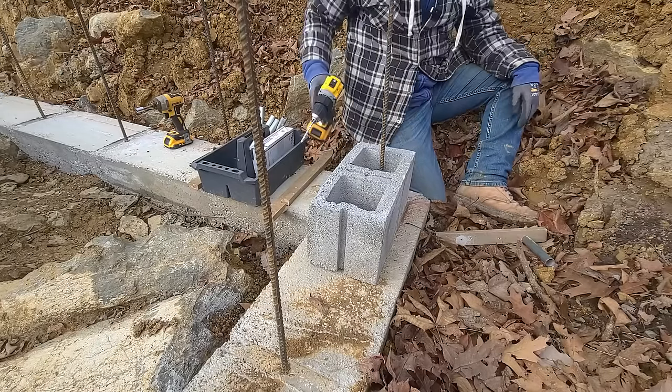All right, you could just use pipes too, the 3/4 pipe. I just thought this would be a little bit more economical for me anyway. A 10-foot piece of pipe these days is like $10. So I got 4 of them for the corners. Then I used just some spare stuff I had sitting around to give myself something to connect this end to. And then the rest could be wood. We could cut it to size very easily and then screw the bottom into the wooden stakes that are going to be in the ground, tying it all together. All right, there's 2 for one corner.